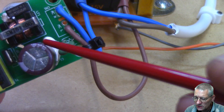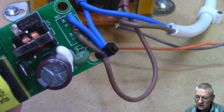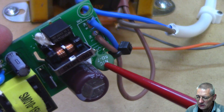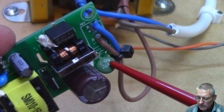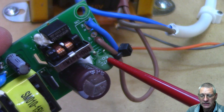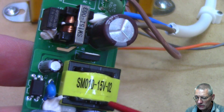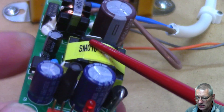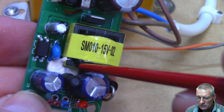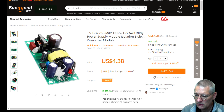I don't know why there's glue on this capacitor here — it's not actually hard, it's a little bit squishy. Whether it's to give a bit of stability, I don't know. The live input goes through this NTC thermistor here — that's 5 ohms. If it's an NTC, when it gets hot it will go lower. Perhaps initially it's 5 ohms and then quickly drops to nothing. Then you've got the actual conversion circuitry here with the transformer. More glue down there too — even the one on the website shows the glue all over the place. Obviously something going on, don't know what though.